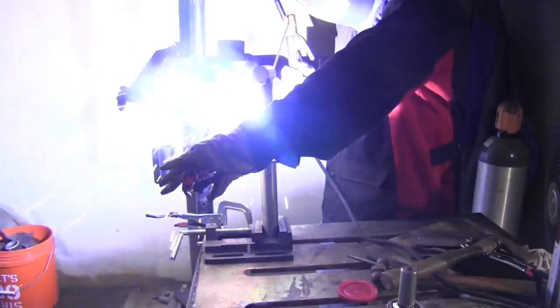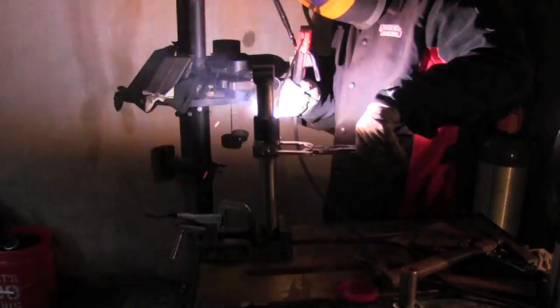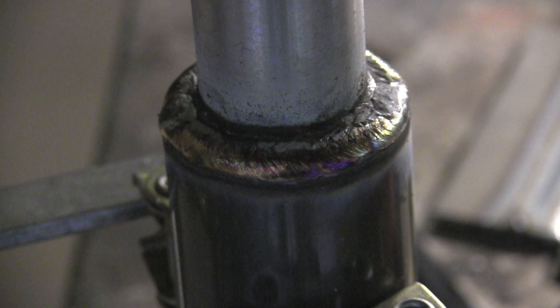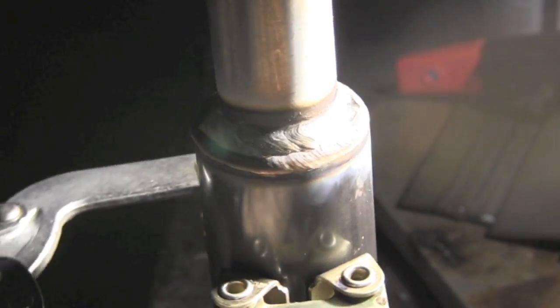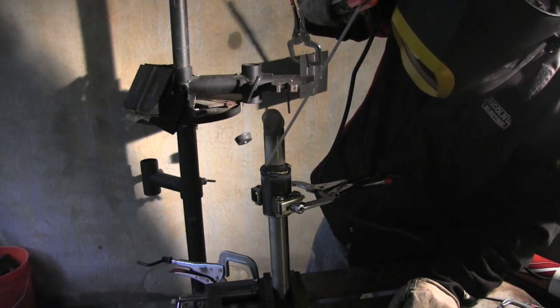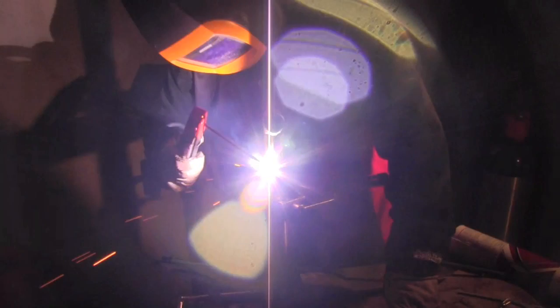I will show you an arc shot here of the next pass. I'm going to wind up putting quite a few beads on this thing. It doesn't really need that much weld because it's kind of a coupler and the pressure is going to be directly against that inch-and-a-half round stock, but I haven't had a chance to run stainless stick in a long, long time, so I definitely need the practice — as you can tell by the way I'm shaking around. It does have a really smooth arc for stick with the settings I used, which is three on the DIG function. The Excalibur rods are doing a really good job. Without the turntable you'd have to get out of position and uncomfortable, but you can make it all the way around whether it's stationary or whether you can spin it.